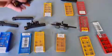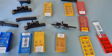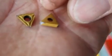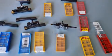As you go to the much larger, more commercial type ones, you can find them for a cheaper price, and that's why I bought them — these are much more superior than the little tiny ones. I've chipped that many of these it's not funny, even without a really heavy load. I've got a few here that are already chipped — you can see on the back how they get chipped. Once they're chipped like that, they just don't work. You can't flip them over or reuse them. That's why the trigon, with its six cutting tips, is the better choice.